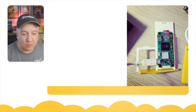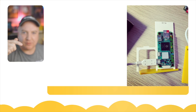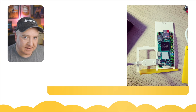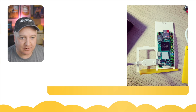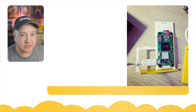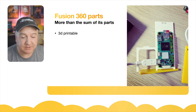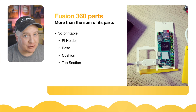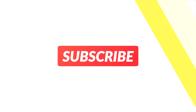What's on screen now is one slice of the Raspberry Pi cluster. You can see power going in — the cable can wrap inside using small angled USB modules so the cable goes in and does a right turn into the Raspberry Pi. The screws are regular 2.5mm screws, sourced from Pimoroni. The memory card at the top is nice and accessible, and there's a slot at the top where the pieces connect to hold it all together — push-fit, no glue. All parts are 3D printable: the Pi holder (white), the base (yellow), cushions for the top, and the top section. STL files are available at clustered-pi.com.